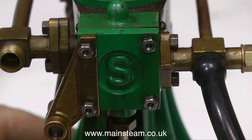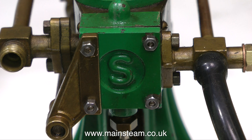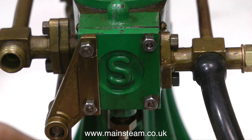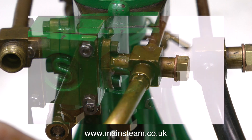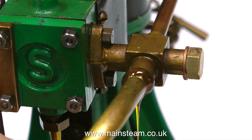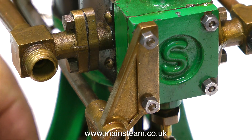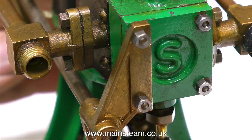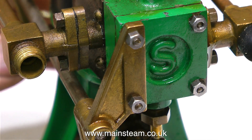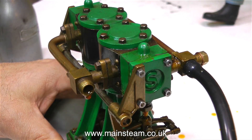You'll notice that this part of the video is speeded up — just a measure to prevent viewers from inadvertently slipping into a coma. And here we see the importance of gaskets. Even with the steam chest bolted to the engine it is still leaking, and leaking quite badly, also around the inlet manifold. So what I'm doing is injecting some oil into the inlet manifold — one reason is to lubricate the cylinders, and the other is to see where the leaks are coming from. As you can clearly hear, the air is just blowing straight to the exhaust and pumping out quite a lot of oil from the steam chest. But it should be doing something — as I turn over the engine I should feel some resistance on part of the stroke, but there's nothing, and the leak is getting really bad.